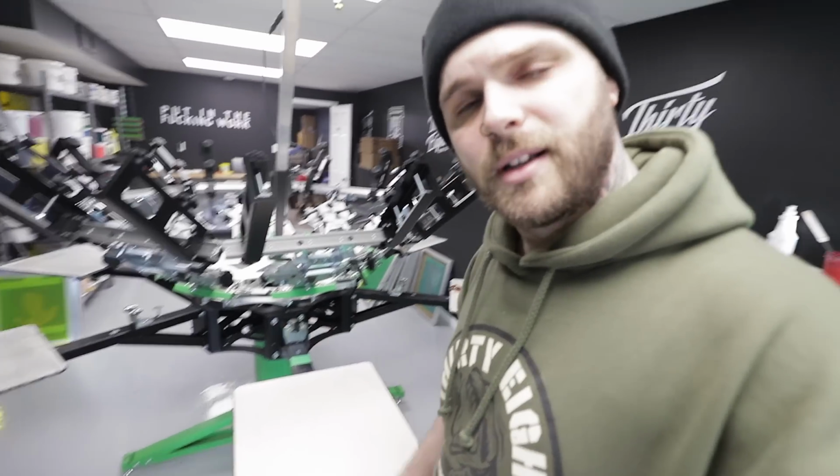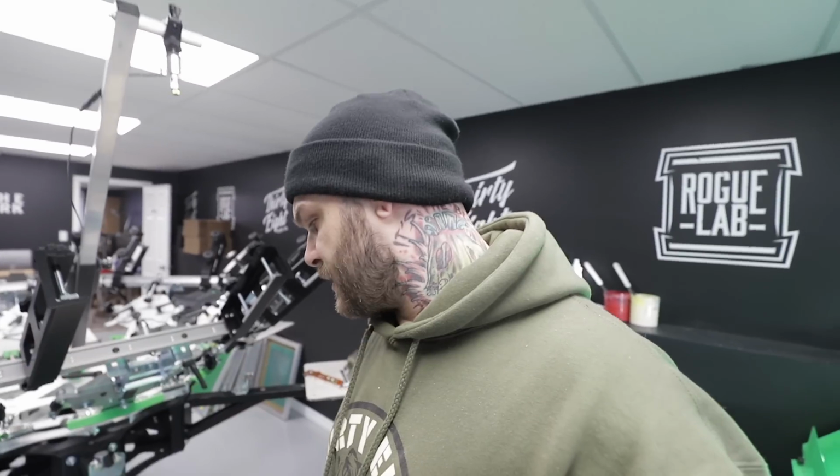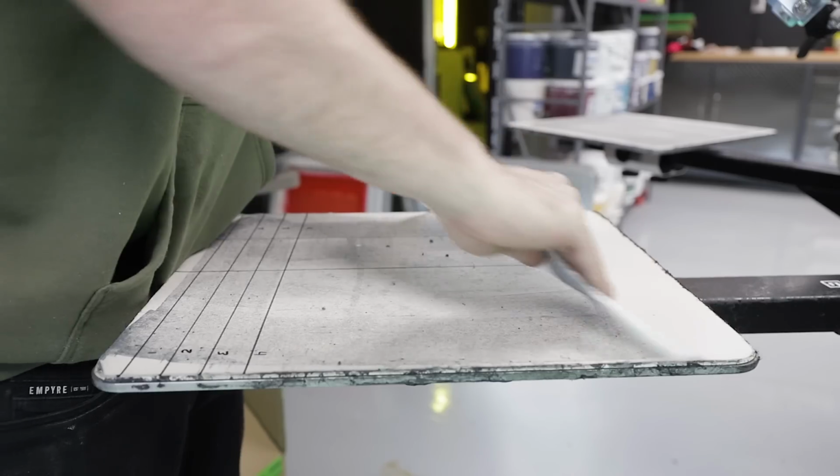We're gonna pull off a pallet, stick it in there sideways, and then put the pallets face to face, because these pallets are aluminum and they're machined perfectly smooth. It does have the rubber on there, but that's not going to make much of a difference. We should be bang on perfectly level to the pallet by doing it this way, so let's give it a shot.